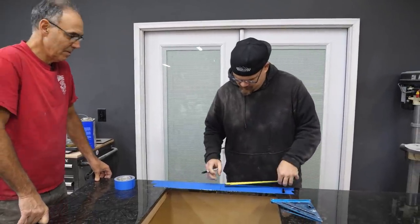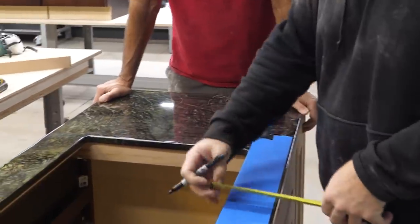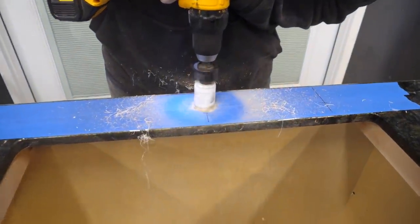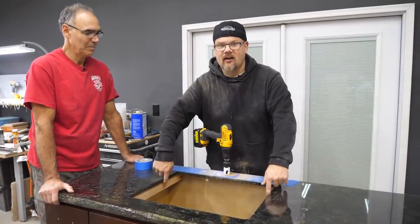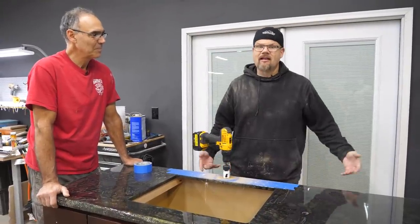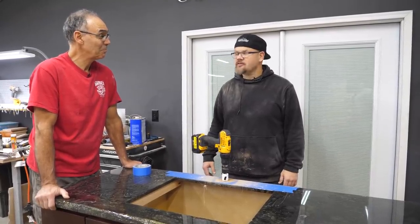Pro tip: 99% of faucets, soap dispensers, buttons for garbage disposals, instant hots, and reverse osmosis — a one and three-eighths inch hole works really good. I typically will come an inch and a half from the front of my sink to where my hole starts. I'm drilling the hole out now on site. You're going to kick up a lot of dust if this is already caulked out, so you've got to protect that. I'm going to red guard underneath this sink to prevent any water intrusion, and because this is already cut out I get to red guard that at the same time — killing two birds with one stone.